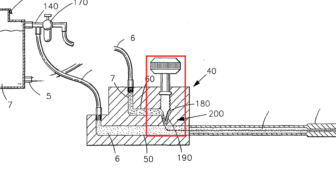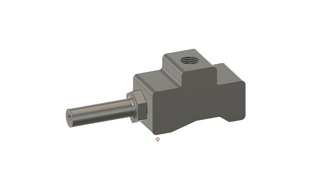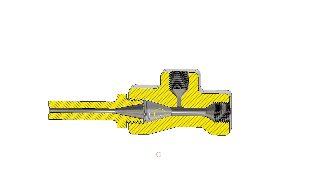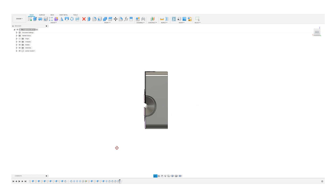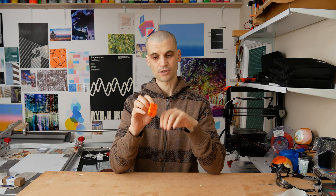The coolant is essentially dropping down into the airflow and getting taken out through the nozzle. First of all, I tested a prototype — you can see the 3D model that I created. The issue I was having with my first 3D printed model was that it was spurting, and I think it was because I designed it with chambers in the manifold. The coolant was pooling up, and once it reached a certain level it hit the airflow line and spurted out. I tweaked the design, made it more streamlined, cut away the chambers, so there was nowhere else for the coolant or air to go — just straight through and out of the nozzle. Making the flow more streamlined really did help with those issues.